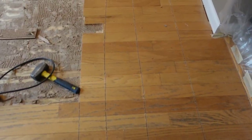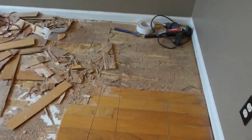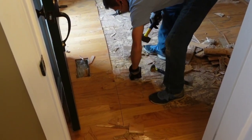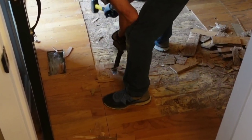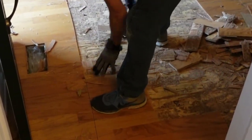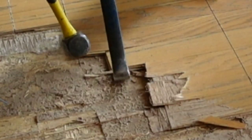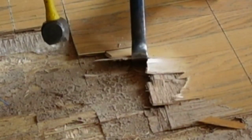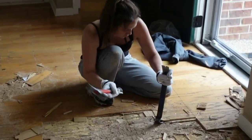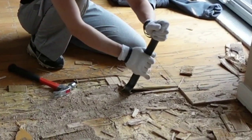In order to have this floor 100% install ready, we've got our work cut out for us. I would start with removing all of the quarter round and baseboard if you're planning on replacing it. Engineered wood is not like hardwood - with hardwood it is one solid piece of wood so prying it up is not that hard. However, engineered wood is made of many layers of plywood with a premium veneer finish on top, so it comes up in small pieces the size of matchsticks.